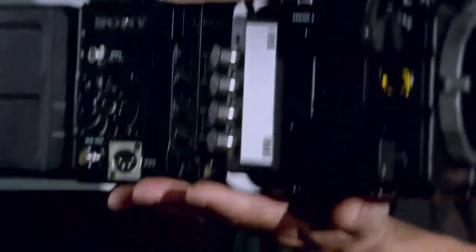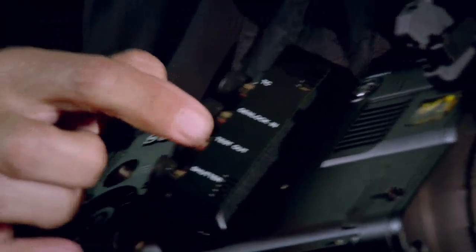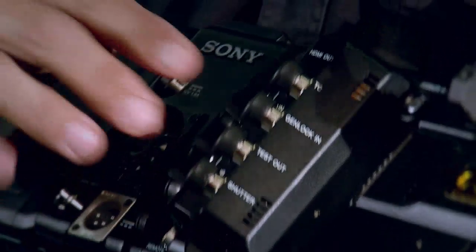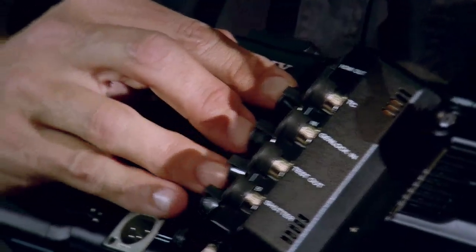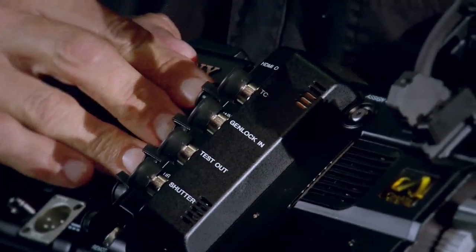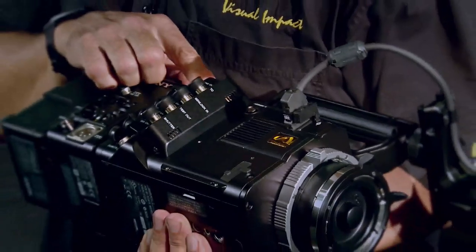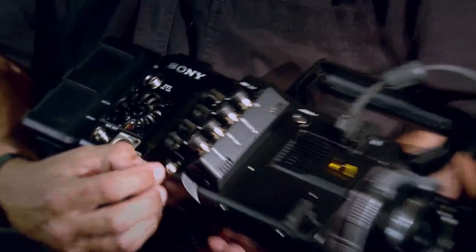Overall, a really good ergonomic shape, nice to work with, with the option to remove the external outputs. The external outputs are the normal suspects: timecode, gen lock, test out, and a shutter pulse. You've got four HD SDIs — four to facilitate 4K, so you can have one cable per output if you want to output 4K for monitoring or recording purposes. It even has an HDMI out, which is quite useful, though HDMI cables are really hard to work with in the field as they break very often. And then there's a standard Sony remote connector.